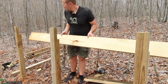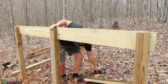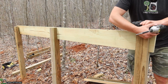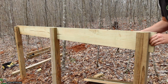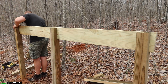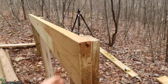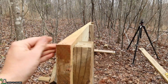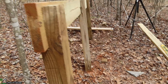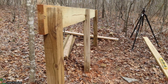It's taken a while, but I finally have all three posts up and the notches cut. I'm just going to match this up and put some screws in the back to hold it in place, and then later I will come back with some lag bolts to keep this in position. The four-by-four is up, the two-by-eight is resting on the notch, and they are all connected together. I need to come back and put a couple of lag bolts in here and then maybe a couple of nails as well. Now I need to come over and do the other set of three that will match up to these — it'll be the exact same.